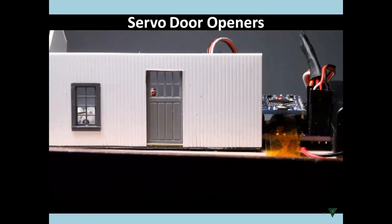Yeah. That's because you can be sloppy if you have that bend in it. Think about it as a linkage for a switch machine throw. If you got that bend in it and you're a little bit off, that bend will take up the slack. So it won't push too far, it won't jam anything, and it works really great. And that's why the bend is there. I kind of like an omega spring, sir. You got it. Thank you.